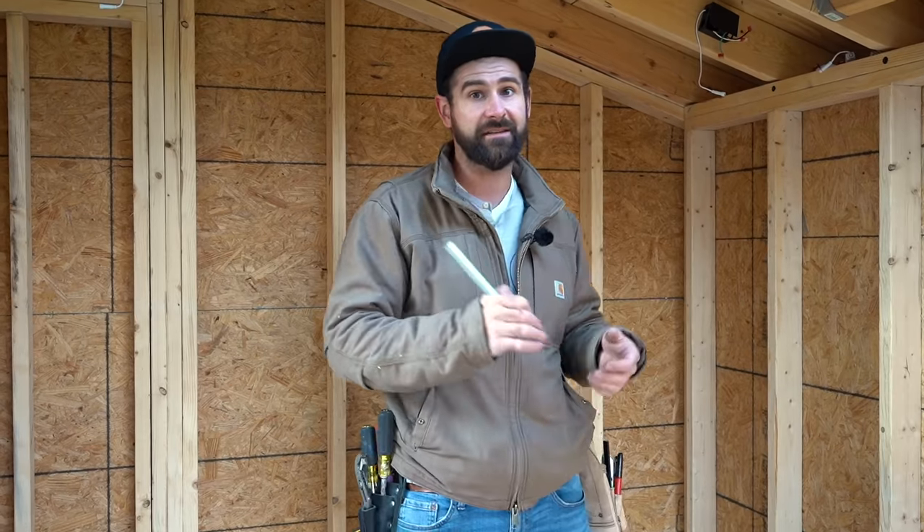Today I want to teach you how to install the steel boxes, how to bend conduit, and go through different bends, offsets, how to measure the 90s, and how to drill up through the plates and joists using a cordless drill, and how to properly strap your pipes. Really start to finish — how to rough in electric using metal conduit tubing and steel boxes.